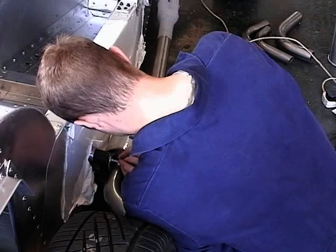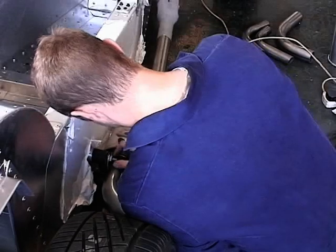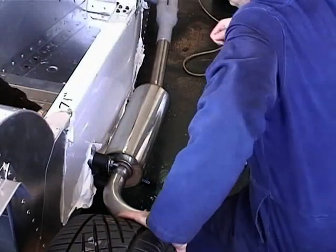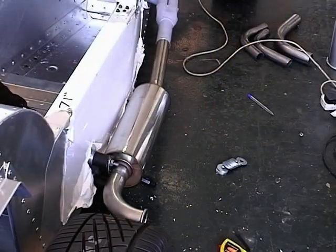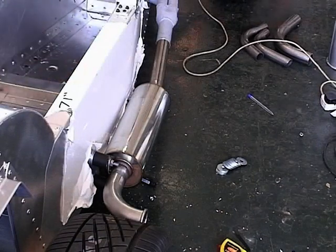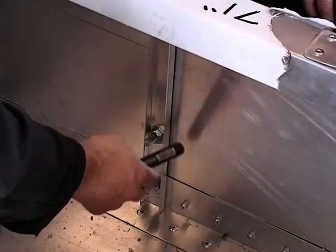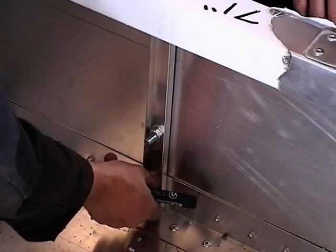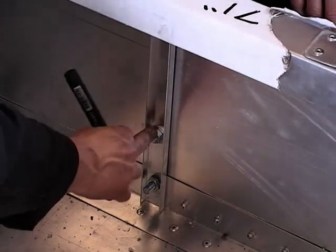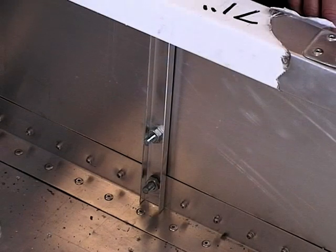You may find also the bolt sections of the bobbin that you're putting on, that you need to maybe cut a slight bit off on the inside here. Obviously you don't want too much encroaching into your driver's hole. So this is what I was talking about before with your thread on the inside of your driver's seating area. And as you can see, there's quite a lot of thread sticking in, and that's obviously an undesirable amount that you need to be having.